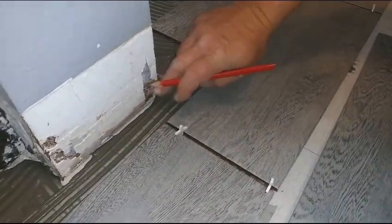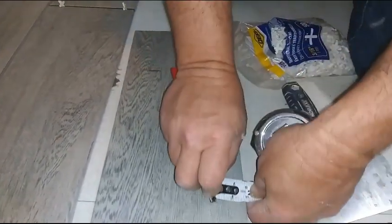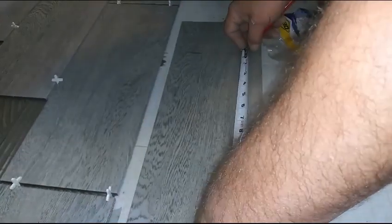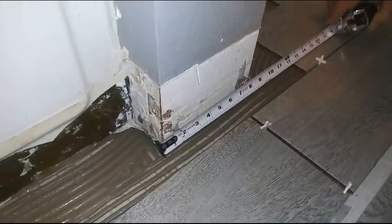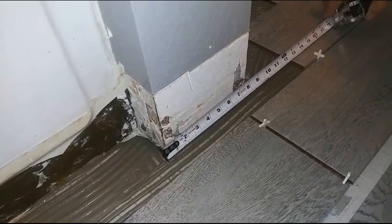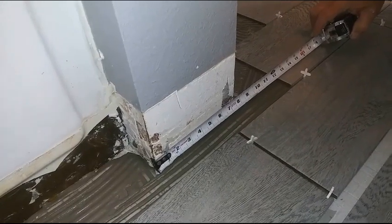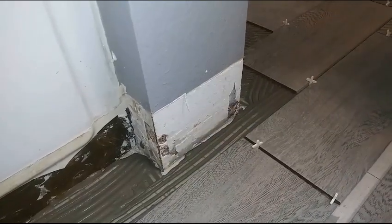Basically I'm laying a quarter-inch on this side and a quarter-inch on that side. I'm doing this like drywall — this is just years and years of doing it. Then the other side: twelve-and-a-half inches, actually twelve-and-a-quarter — that's tight. I'll do twelve-and-three-eighths.